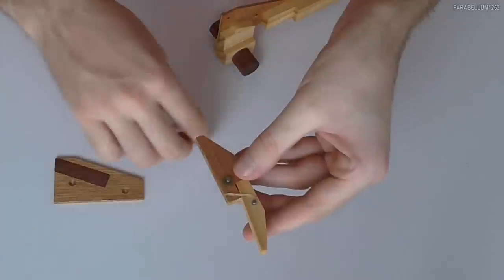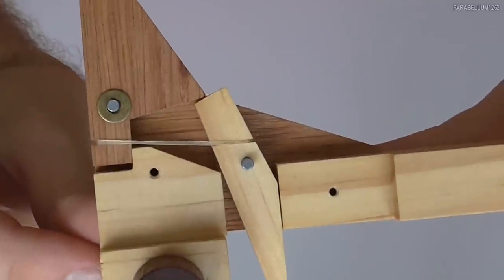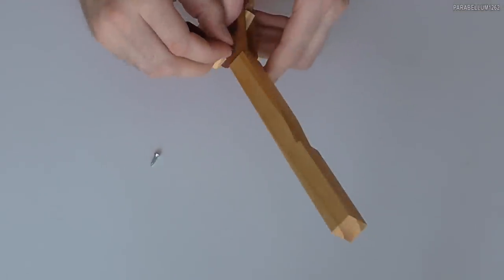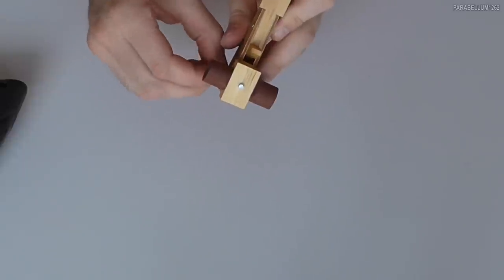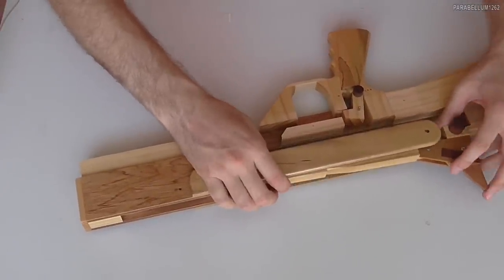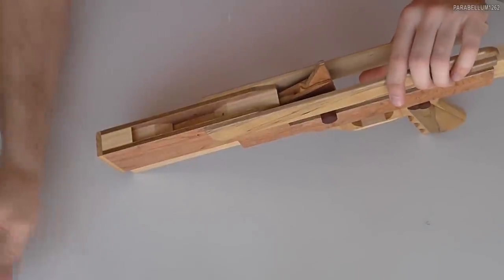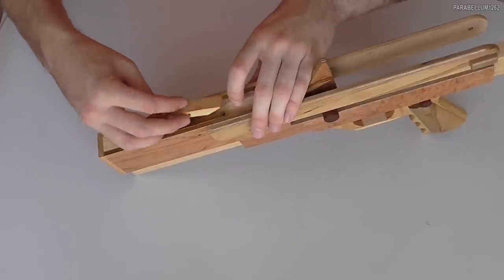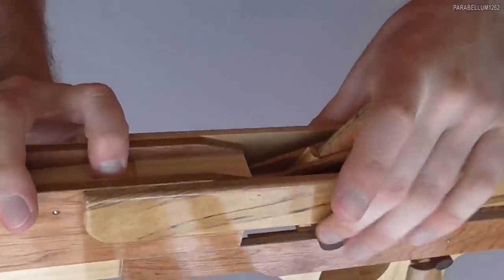These two washers help take up any slop. It's hard to install these parts on camera, but they should look like this. Finally, screw the side plate on. It is easier to install A20 with the bolt in. Remove the bolt once it's installed.